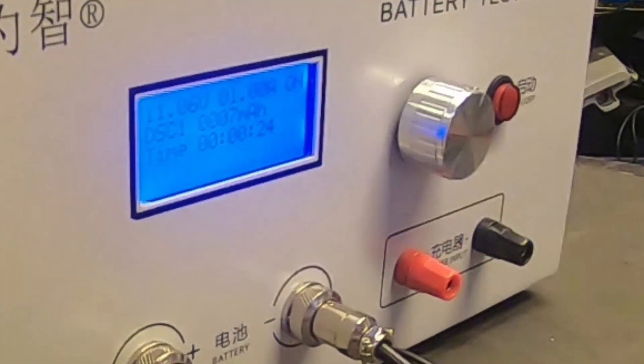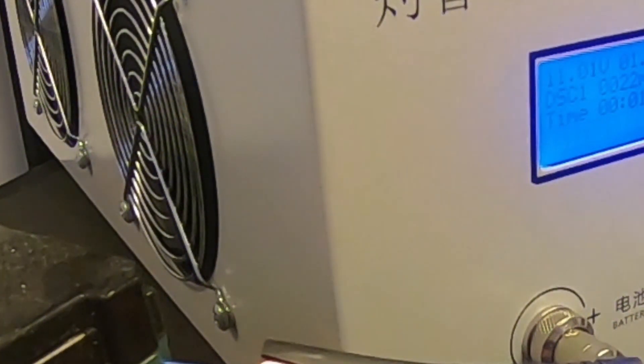It's already sounding like a vacuum cleaner, and this one should be able to pull 20 amps on this poor little 10-year-old lead acid cell. This battery tester is for 12 volts up to 72 volts. I actually had a smaller battery tester like this before but it disappeared after a year. I looked everywhere for it, so I bought this really big tester from China to be able to test battery packs a little bit faster at higher amps. I have other testers but I usually just run them on one or two amps. This is a good investment.